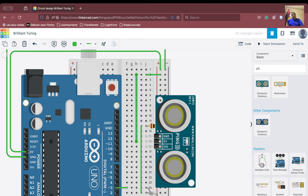Okay, now we have to connect the ground. So how do I do that? Again, we will take one connection, the wire from here, and connect it to this place, and then we'll come here. Remember that this column is connected to the ground. We come here and connect it to the ground pin here. So the ground connection is coming from this particular pin, coming here, going here, and this particular column is connected to the ground pin, as you can see. Okay, so the connections are done for the ground and 5-volt.